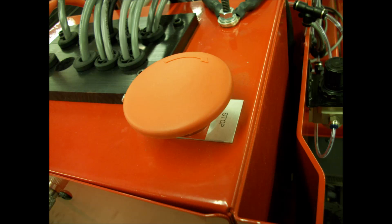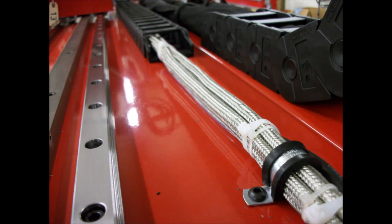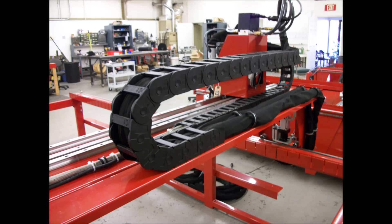The box is mounted to the gantry to keep motor cable length short and prevent electrical noise interference from the plasma. On all high-frequency start plasma systems we utilize our XLR8 drive system, which is hardened against EMI and uses braid-shielded cables and filtering. The communications to the PC are all fiber optic for total noise immunity. Non-high-frequency systems may use either the XLR8 or the XLS drives depending on application.